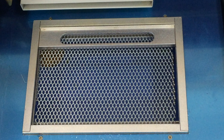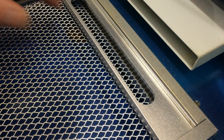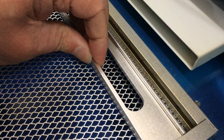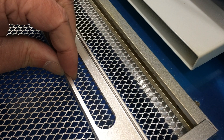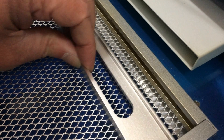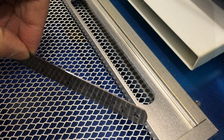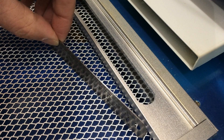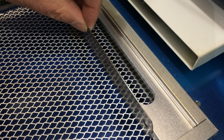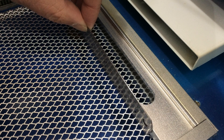Then, with a little persuasion and trimming in certain areas, I was able to fit the grill into the frame. The shorter tabs that I folded face downwards into the cavity so they don't interfere with the spring clamp. The long ones fit over the sides of the U-section and under the edge of the frame. This is important and makes use of the frame to hold the grill flat in the X axis. The folded tabs keep the grill flat in the Y axis. All of this is pressed up against the bottom of the frame, so we should have a grill that's level relative to the rest of the machine.